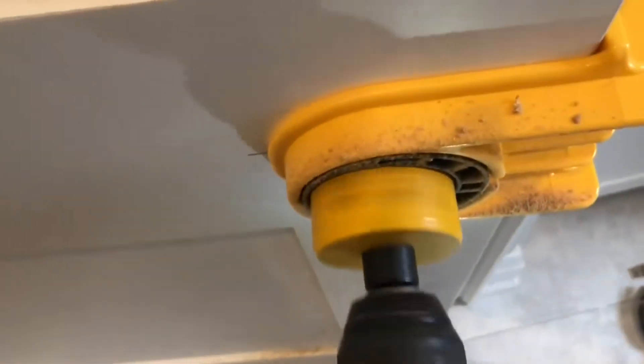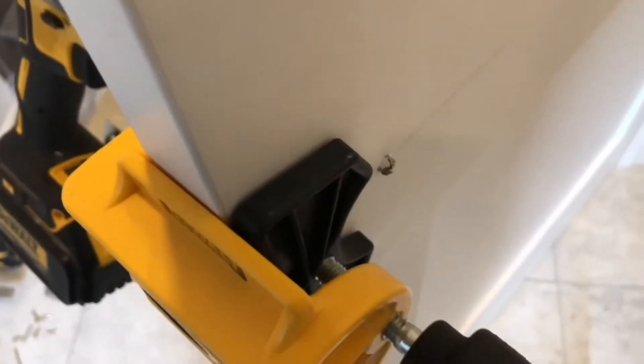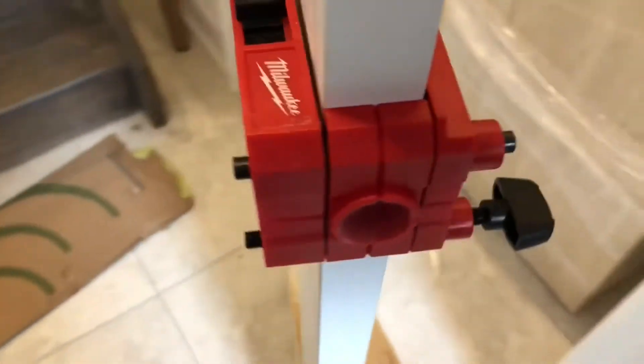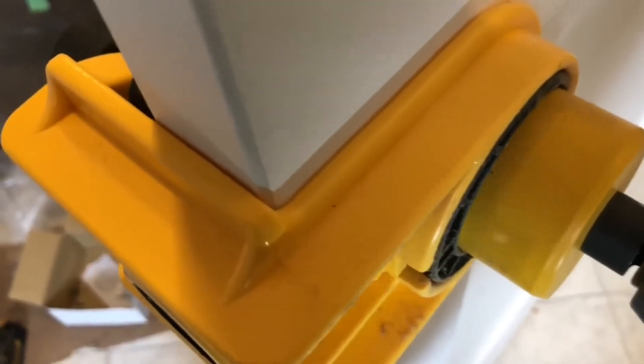Make sure you don't twist your wrist. I'm watching the bit come through the other side of the door. Now let's see how the Milwaukee lines up — we're not actually going to test anything. Milwaukee lines up perfectly, so as you can see both units are really close. Going to the other side of the door and sticking the hole saw in, you can see it's on par. We finish drilling this out and you can see that both units line up. My practice of cutting through one side until you see the drill bit appear is correct — you go through the other side and have two beautifully aligned finished surfaces.